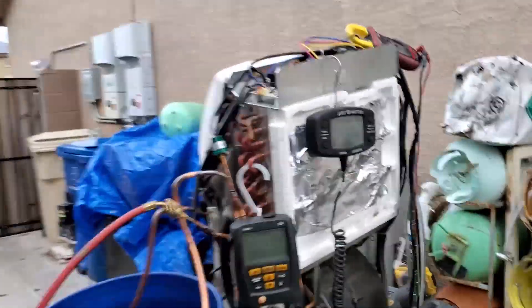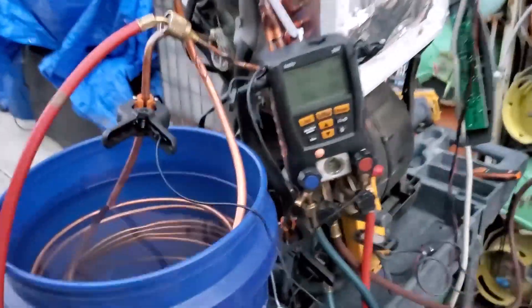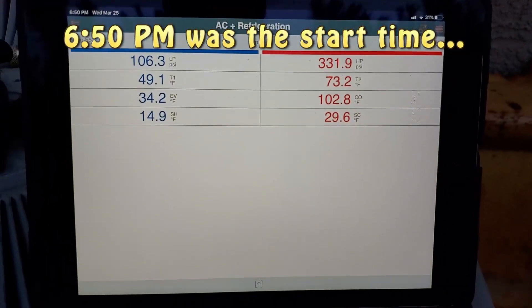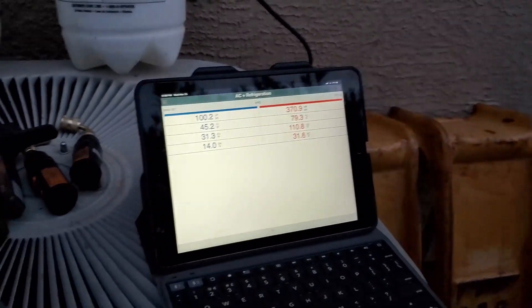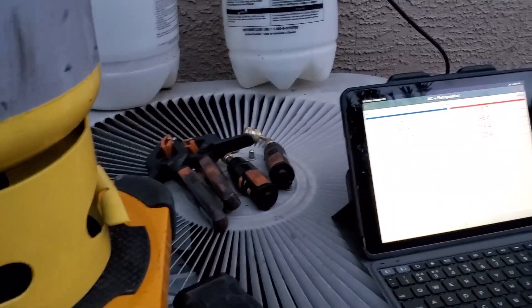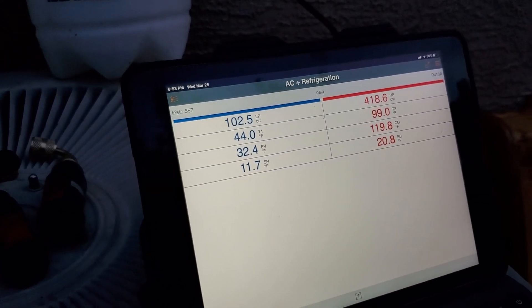Still racing for time, it's coming down. I think it just kicked on the compressor. Hoping there wouldn't be a long delay. Suction line's already a little frosty — I probably caught just a pinch too much refrigerant in there. Pulled out some refrigerant, superheat shot up, so I put just a pinch back. Dropped back down.